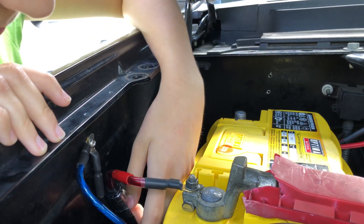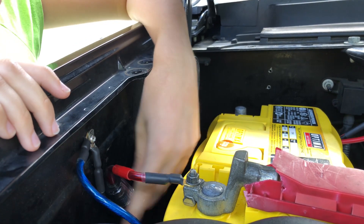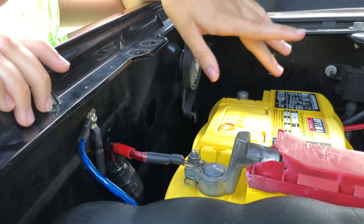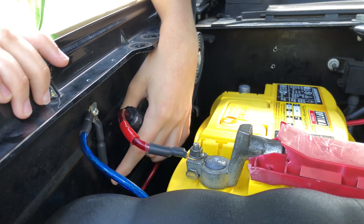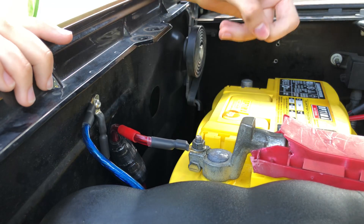There's a short ground wire connected to the filter, so we had to ground it right over here, but we needed it also to be connected to the main ground which is over there, so we ran a black 8-gauge, 8 AWG wire over to the main ground.